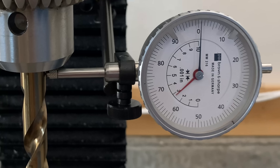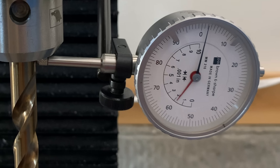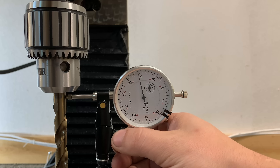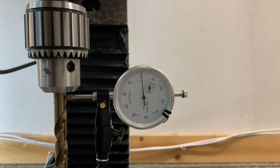And finally we have the mystery chuck, which is doing amazing — barely any runout at all. Maybe a couple tenths at the most. I'm using a German-made Brown and Sharpe dial indicator, but I wanted to confirm the accuracy with the indicator I trust the most. I set my Pittsburgh up, and yeah — a couple tenths. Fantastic.